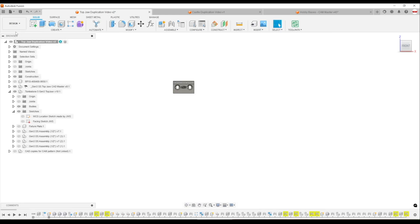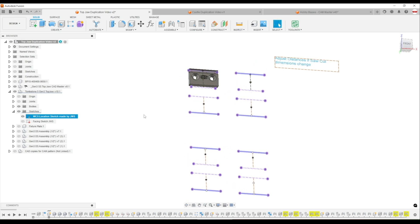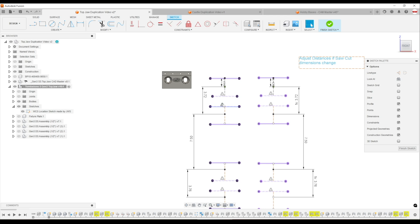The solution is a single sketch that drives the instances of that pattern. If I hop back into the design space under my tombstone, you can see the fixture plate there that I normally leave hidden. Under sketches, I have a WCS location sketch. I like that I can name the sketch — it makes it easier to find and describes what I'm doing. If I toggle the visibility on, you can see the instances with those dots representing the point I'm going to use for the pattern. As a bonus, you can use this sketch to store notes to yourself about peculiarities of that fixture. I have my one position — the top left one — and from there I've anchored these distances relative to each other.